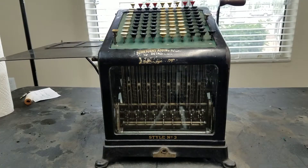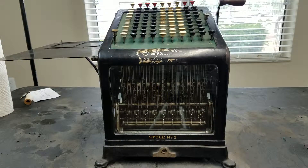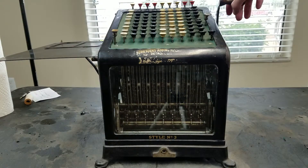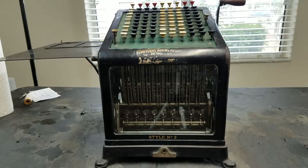So now back to the Burroughs. We've determined that we're going to enter 4 in that column. Now we're going to enter 5 in this column, because that's the complement of 1 less than 5, as we discussed. The rest of the columns we also have to enter something because of complements — we want to enter all 0s in the rest of the columns: 0, 0, 0, 0, 0, 5. And then we also have to push down all the 9s, because the 9s are the complements of 0. And if we pull the handle here, we can see that we have now subtracted 5 — so now we have 20, where we had 25 before.